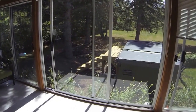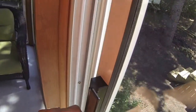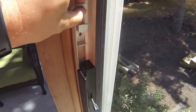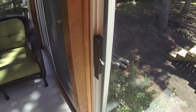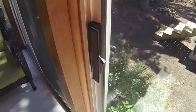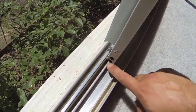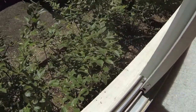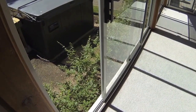The doors are on and sliding nicely, which is great. However, there's one small problem: this lock closes in fine, but I forgot about the screen door which runs on this track. This would be a good setup if I didn't need a screen door, but the screen door is going to get jammed. I think I have to take the doors back off and switch the tracks — put this door onto the other track. Unfortunately I think I'm going to have to take both of them out. Yuck.